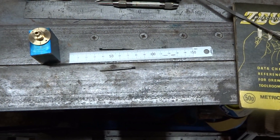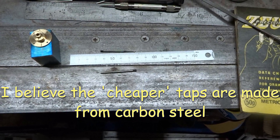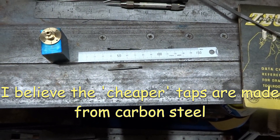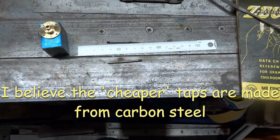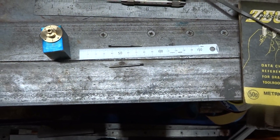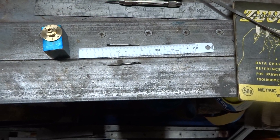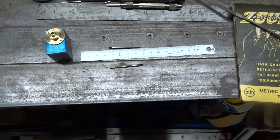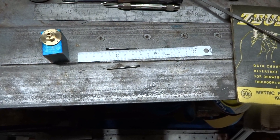The cheaper taps, which typically are not high speed steel but are made from some sort of hardened material, they don't work so well. I think primarily because they don't seem as sharp as the high speed taps, and because they're not as sharp, they tend to get more readily broken. Anyone who's ever attempted to extract a broken 10 BA tap from a hole in a part will understand the difficulty, and most times the impossibility, usually ending in a scrapped part.